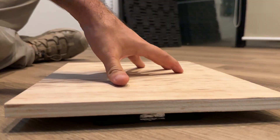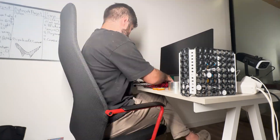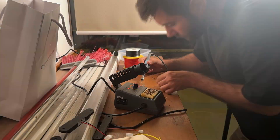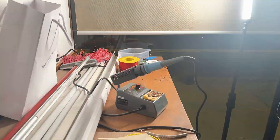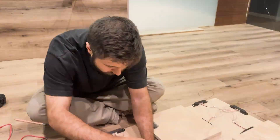By that time the glue on the pads had dried so I could finally start testing. After that first successful test I had a full-on marathon ahead: printing parts, cutting and sticking aluminum tape, punching holes, threading wires, bending and soldering everything together. After assembling everything and simply placing the buttons on top of the sensors — not even fixed yet — everything seemed to work. At least that's what the multimeter said.